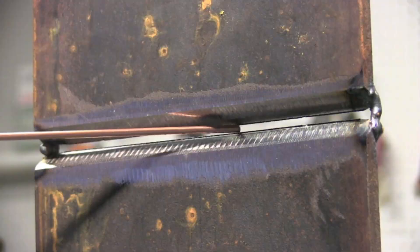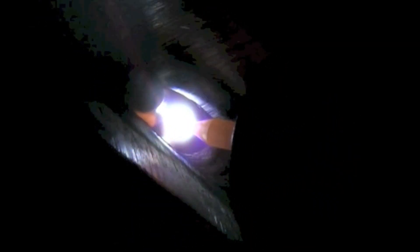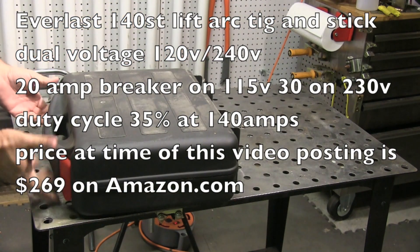Another thing is just any open root pass. This is a plate — not that commonly done — but it is done for practice when you're getting ready to take a pipe test, and it works really well for open root passes. This is a technique I like to use: doing a forward and back with a lay wire, 1/8 wire, 1/8 gap. You just have to figure out how to snap out of the puddle.